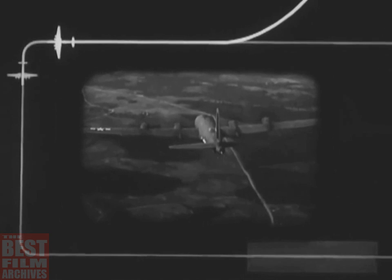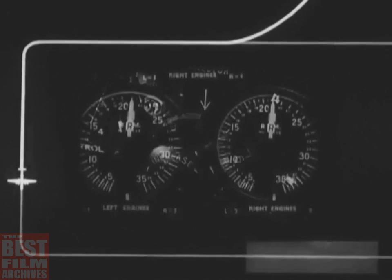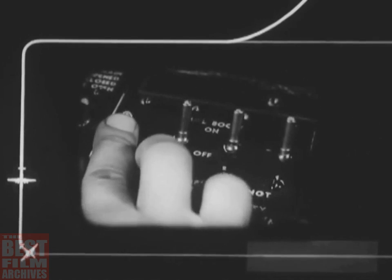After the pilot makes the procedure turn, the altitude should be 2260 feet. The co-pilot lowers the flaps to 25 degrees. The pilot sets the manifold pressure selector to position 8 and adjusts the propellers to 2100 RPM. Just before the final turn, the engineer checks the magnetos and turns the boost pumps on. Around the turn, on the final approach, speed should be at least 140, altitude 800 feet. Also, 6 generators should be on. Finally, the co-pilot lowers the flaps all the way and calls out airspeed and hydraulic pressure as the ship descends to the runway.